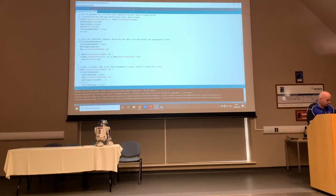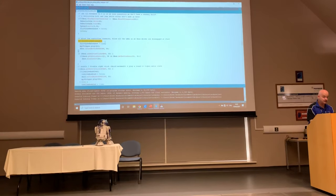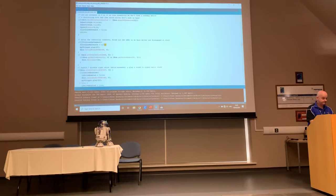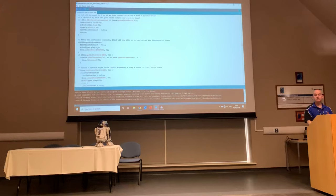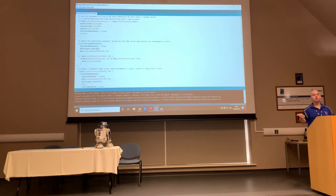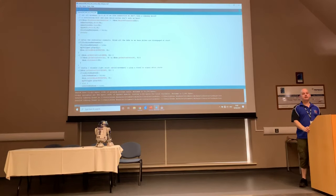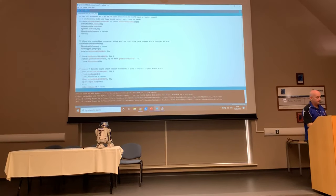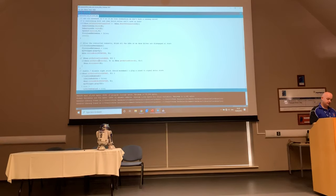Okay, so we'll skip on a little bit. What we're going to do here is say, when we first connect, in other words, if our connection is true, then in my case, it's going to go to the MP3 trigger and play track 21. So I get an audio cue from my droid that my controller is now connected. It'd go, whatever the whistle is that mine does. And then it will say, okay, rotate the little thing.